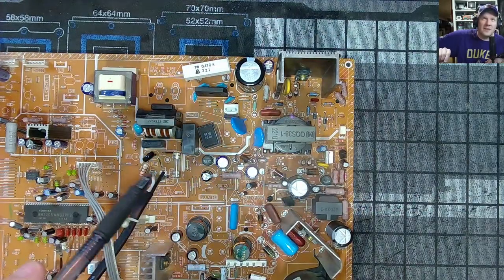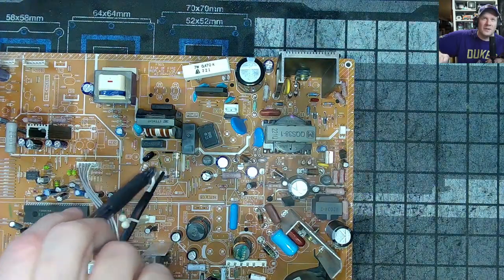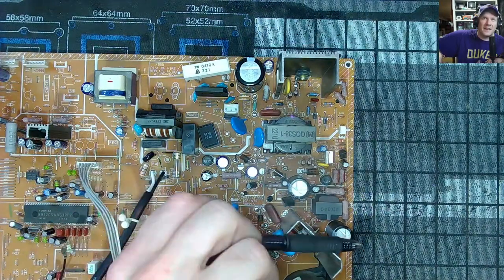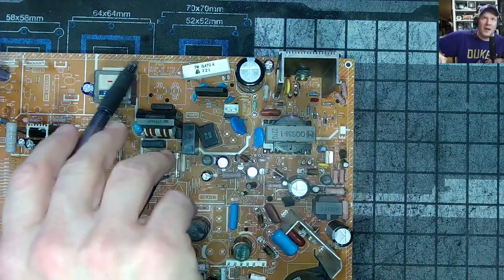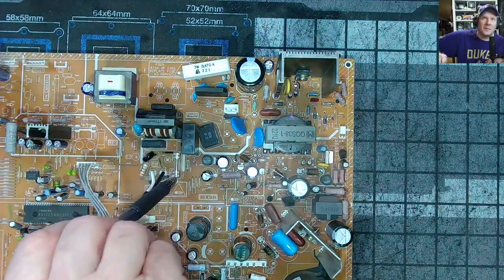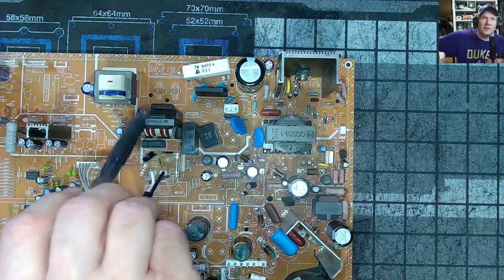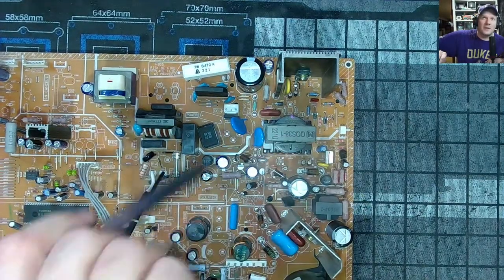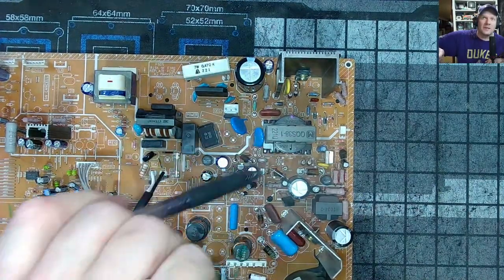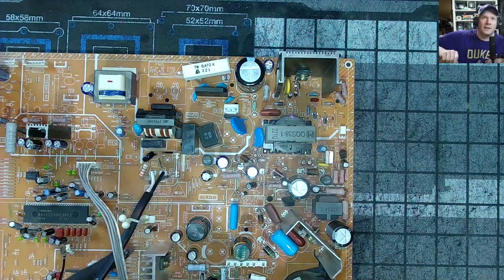So if this was a PVM, this would be isolated onto its own board. Since it's a consumer-grade CRT, it's been incorporated onto the main board, and that's why you see the power comes in here, main voltage, then you have a fuse, then you have transformers, transforming it down into whatever it's stepped off and needed into. Obviously, you have high voltage going over here to the flyback, and then...